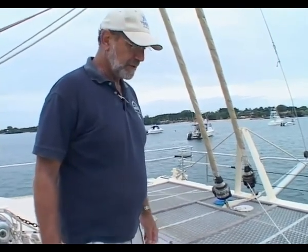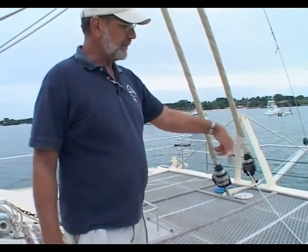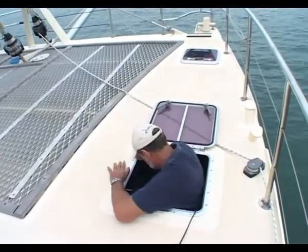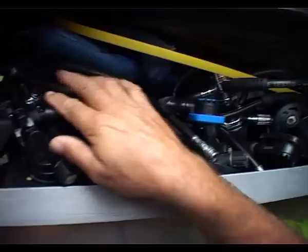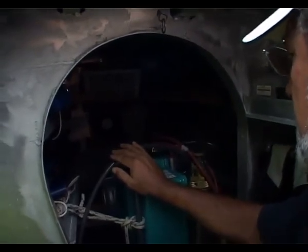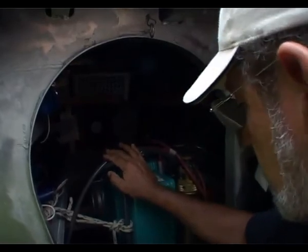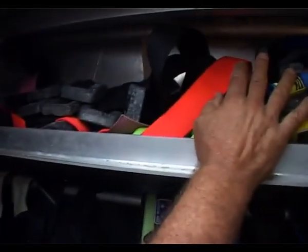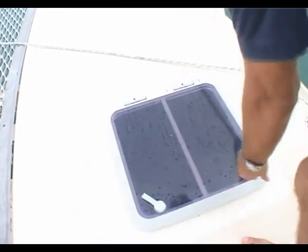There's a full watertight bulkhead in front of the starboard cabin. Either side we have port and starboard cabins, and on the starboard side we've got the dive store. Another watertight bulkhead, then we have storage for the dive tanks. Going through the dive compartment — it's full depth. We've got six complete sets of gear with numerous spares — octopus regulators here. We have the Bauer Junior compressor, 240 volt, which has done about 200-300 hours. Below that there's a 300 Clisby compressor for hookah diving and also to supply air to paint the vessel. BCDs, weight belts, face masks, snorkels, fins — all the paraphernalia you need to go diving.